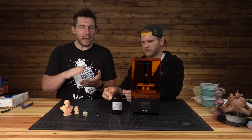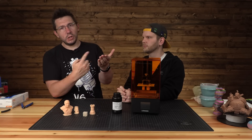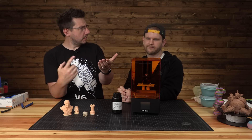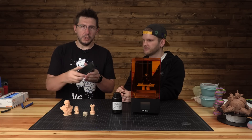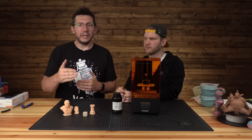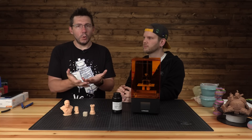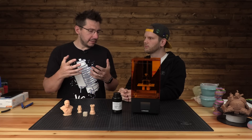The machine itself is a UV LCD printer. No matter how many models are on the plate, it all takes the same amount of time — unlike the Form 2, which uses a laser and galvanometer going back and forth curing resin in lines. This one uses an LCD similar to a phone screen; at the bottom it produces UV light in the shape that each layer needs. So what takes time is the number of layers, because it does a whole layer at once. You can know just from the layer count how long your print will take, with no variation based on detail.